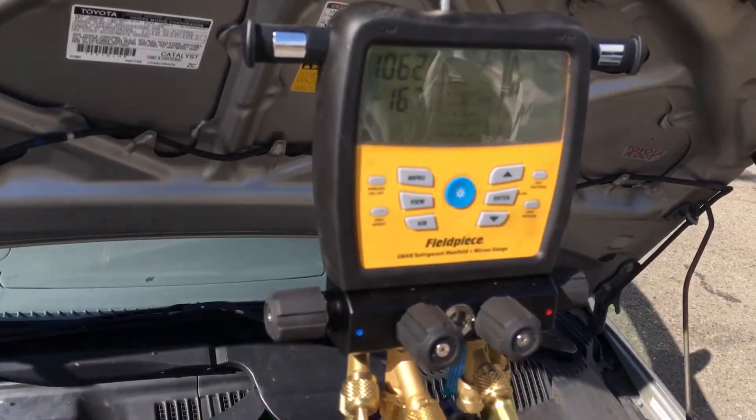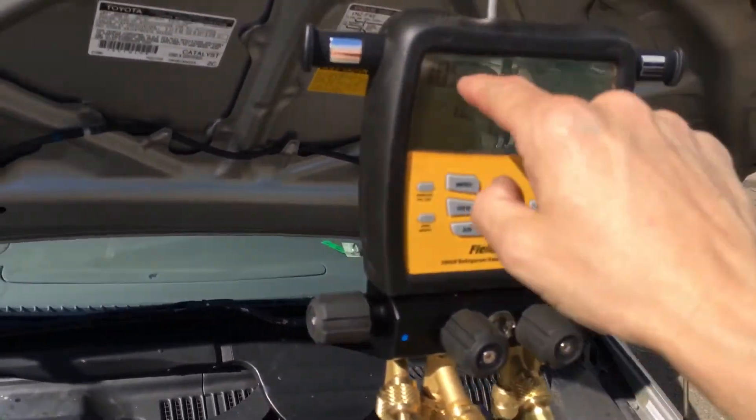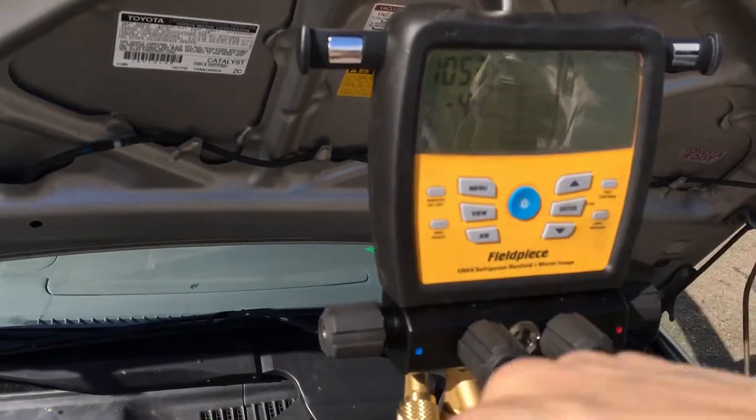We're really not rising, so I have no big leak that I could read under vacuum. I was able to get way down here really fast and level out. Unless it's a leak, I'm going to bank on there's no leak under vacuum, but there is a leak under pressure.